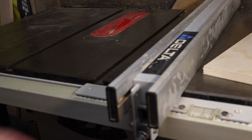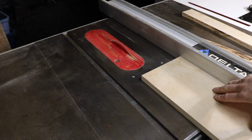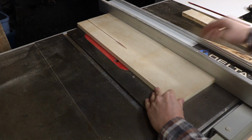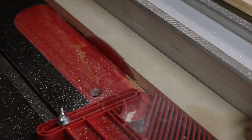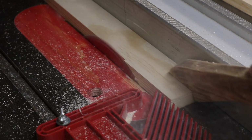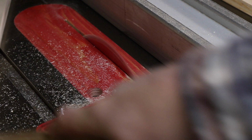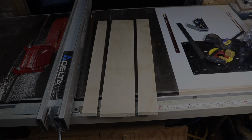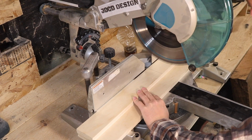So I'm going to go ahead and grab some plywood. The good thing about this jig is it's pretty small, so you can use scrap pieces of ply in your shop. The first thing I'm going to do here is rip all the material down to their correct widths. The reason I made the footprint of this jig fairly large is so you have a lot of clamping room, so you can clamp it down to your piece when you're using the jig itself. Like I mentioned earlier, you can alter this to make these sides smaller, and obviously change it to whatever router you have.